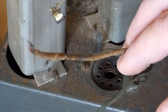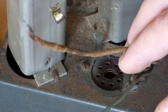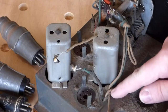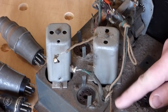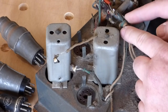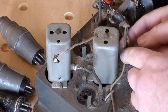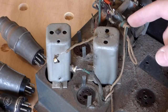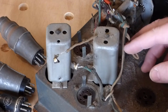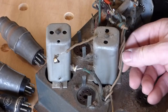The aerial and earth wires are just tied to the chassis with an old piece of string. Given the rest of the construction of the set I wouldn't be surprised if that's factory, although there's a knot up here where the earth wire is soldered to a fairly hefty lug on the top. So it's also possible the aerial and earth wires were just connected by that solder tag and someone added the string at a later date to give it a bit more strength. I'm not going to change much about that other than just to replace the aerial wire.